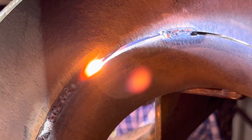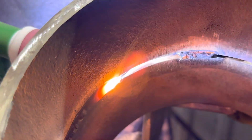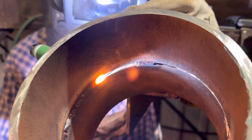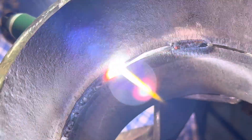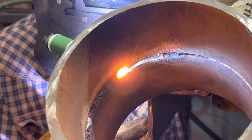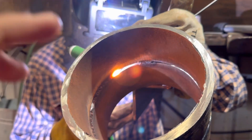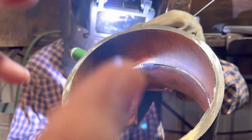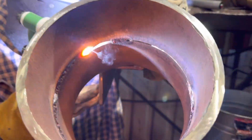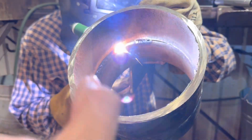On the top, the wire is not as deep into the bevels — just a little bit inside — and he's keeping tension on it. When he has to feed, he'll just dip it. If the gap starts to tighten, use the tungsten to open up the walls and then dip some wire. If it's way too tight, bump the heat up 5 or 10 amps. He's kept the same amperage all the way around because his tacks were solid and he did the bottom side first.